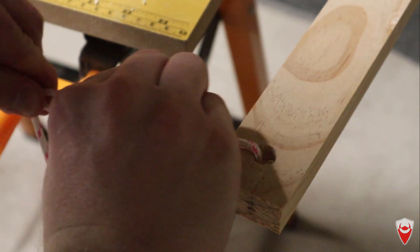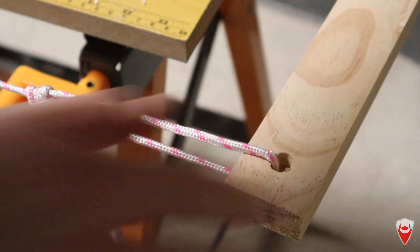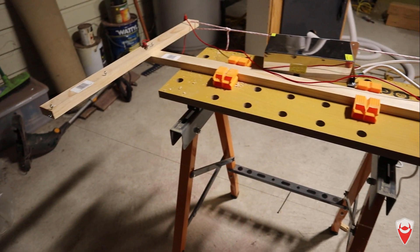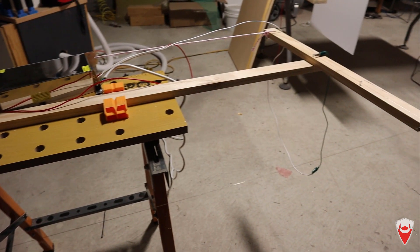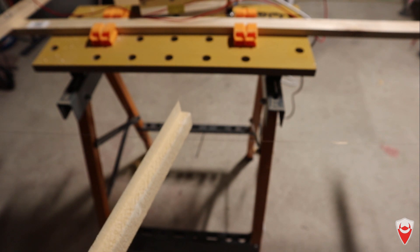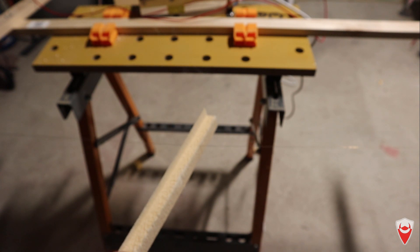The wire is tensioned using a little sliding nut, and we can get the whole thing to a nice tension. I present to you WireCutter 1.0. It's 1.2 meters between the arms, tensioned through the use of string in the back, and it's powered by approximately 48 volts DC. And the question is — does it cut? Just got a piece of polystyrene foam here. That cuts!